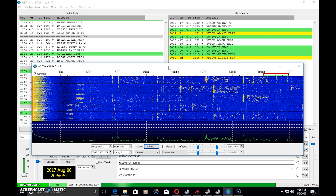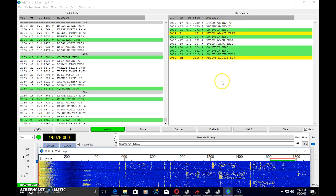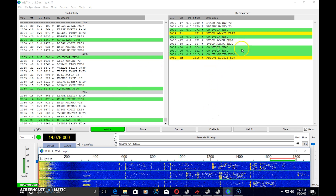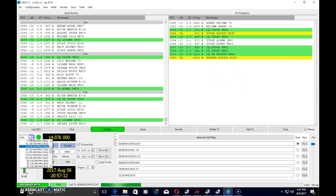The software link is in the description. The receive frequency shows stations I'd be calling CQ and what I'm receiving — they'd pop up in red. The band selection on the left shows different bands and the allocated frequencies for each type of digital mode: JT65, FT8, JT9, PSK — there are all kinds of designated frequencies. If you have rig control or CAT control, simply clicking on these would change the radio to that frequency and show you DX call, DX grid, azimuth for beam heading, and distance.